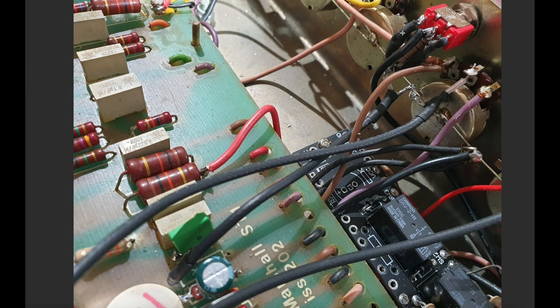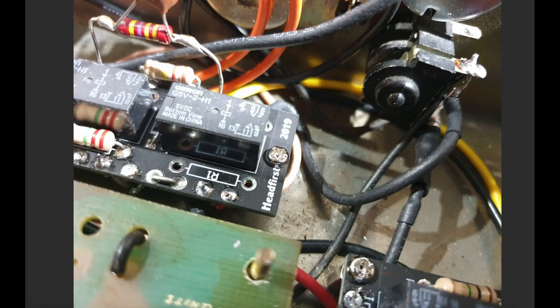Underneath the heat shrink here are the Zener diodes, which are just wired in series. All right, so here we've got the two 20 volt Zeners, and here we've got a 24 and a 5.1 volt Zener. They all connect to the same point here. Okay, and that same point is connected to the signal wire of that coax. It all matches the schematic. What I'm doing here is trying to show you how to wire all the stuff in, because it's one thing to look at the schematic, it's another thing to actually implement it.